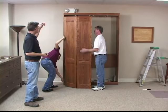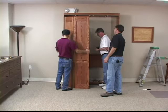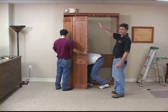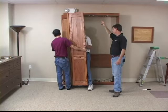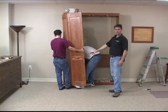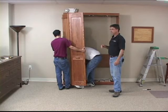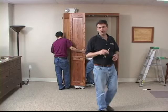In terms of the hardware for the hinges, it is a 5/8-inch number seven screw — a 5/8-inch long, number seven diameter screw. The lock rail is towards the bottom where the handles are. The hinges are 270-degree hinges, which if you don't have bookcases allow a full wrap — they'll completely wrap around the sides. There are holes already established for you. Someone needs to lift the door and align it on the holes. There are three screws per hinge and two of them are adjustable. The first thing you should do is put one in an adjustable screw hole, set another one down below, check your heights, and then start locking them in progressively. We are using a screw gun on this, but when we fine tune it we use just a regular hand screwdriver.